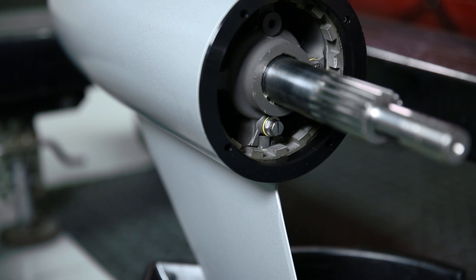The next step is to remove the propeller. Removing the propeller is very easy and we have many videos on the Mercury Marine YouTube channel to show you how to properly remove and install the propeller. Once your propeller is removed, you should see a drain plug near the bottom of your gear case. This rear drain plug is where we release the oil from in the gear case into a proper drain pan.